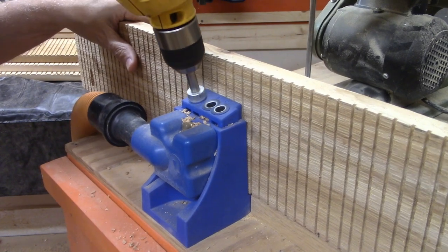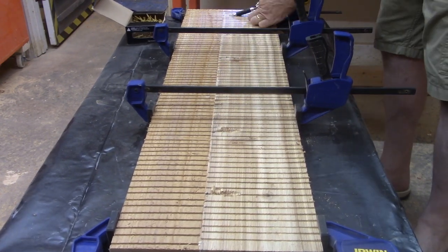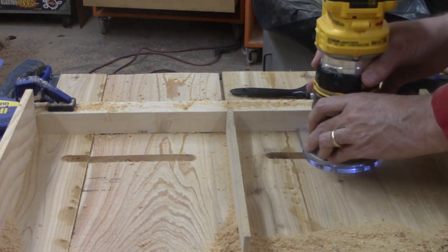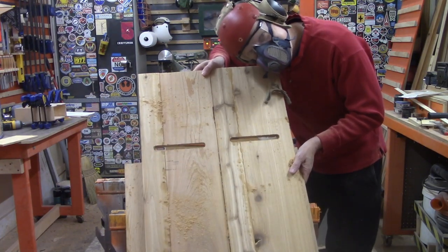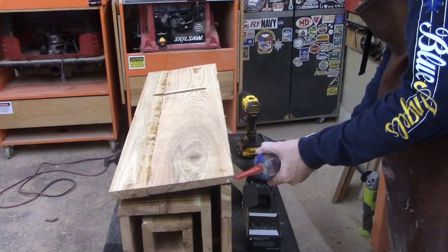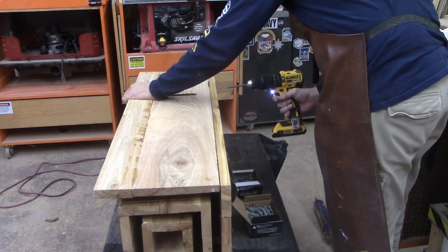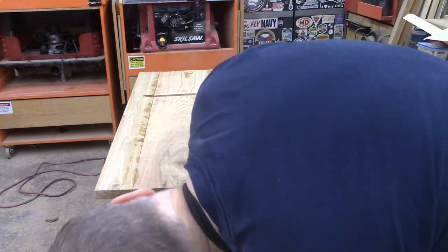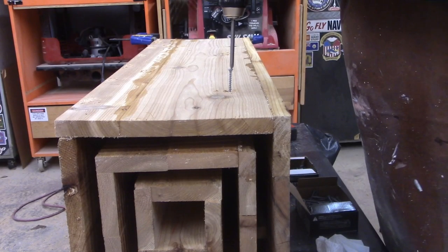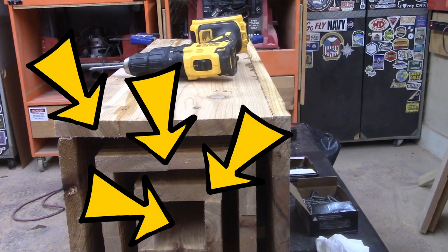The outside box is nearly a foot wide, so we used pocket holes once again to create a larger board, slotted it, and assembled it just like the other boxes. The bat house plans called for two slotted vents on two of the panels on the outside, so I used my trusty router to route those holes and give the bats a little air. Once routing was complete, I got rid of the sawdust, flipped them over, and applied polyurethane to deal with all the bat guano. The final box was assembled with caulk on the edges to seal it against rain, three-inch exterior screws to hold it all together, and three-inch screws into the standoffs. Now we finally have the box outside of the box, outside of the box, outside of the pool!